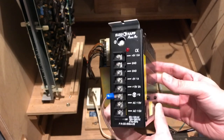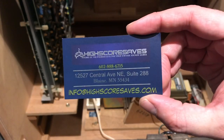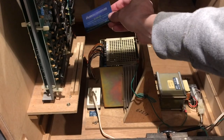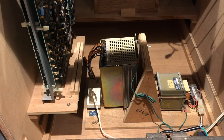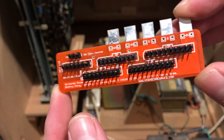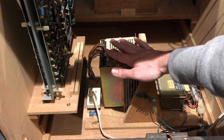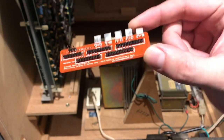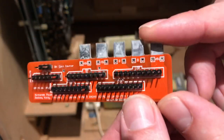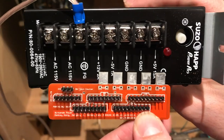All we're doing is taking out this power supply and putting this one in. I've gone to highscoresaves.com - this is where I got the high score save kit as well. I ordered the part for the power supply swap - this little daughter board or jumper board. It means we can remove the original connectors on the power supply without cutting any wires. It's got the 5 volt, ground, ground, minus 5, 12 on both sides matching the pin out.